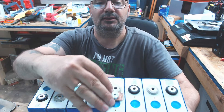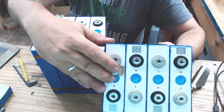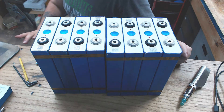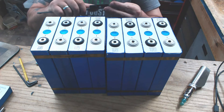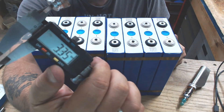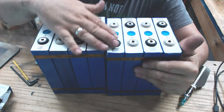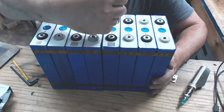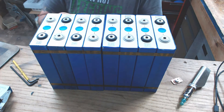If you look here, you may be able to see the thread hole size difference — if I angle my camera — between the quarter-20 and the original. Let me grab a quick internal measurement. It looks like I'm grabbing the minor diameter, so I'm guessing 3.54 millimeters. Actually, it is four millimeter — that's what they come with. So totally too small, too anemic. By the time you put enough torque on it, it starts to yield.